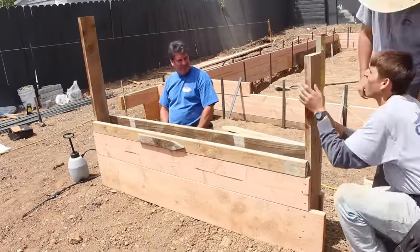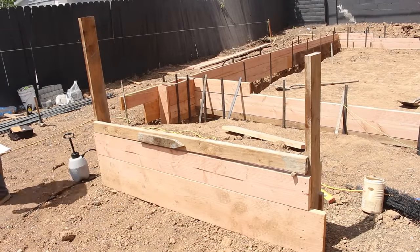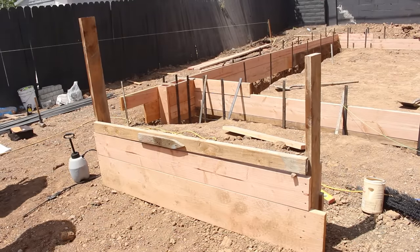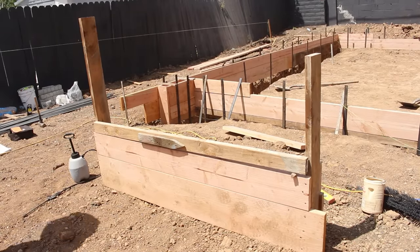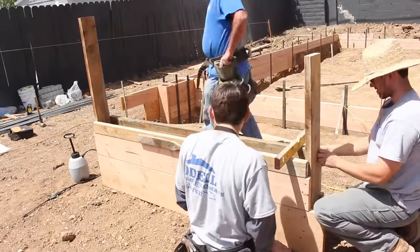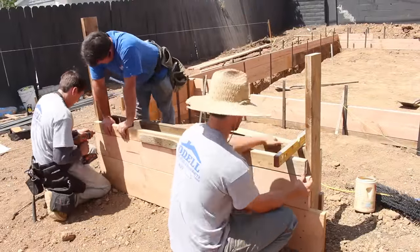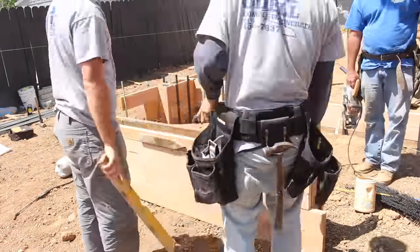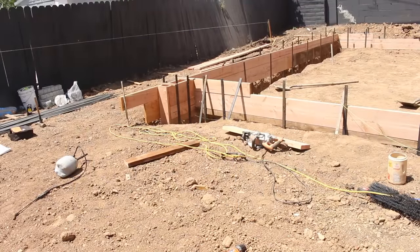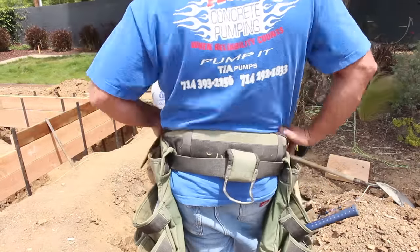I'm building this little freestanding form outside of the actual location where it'll inevitably go. I've got a two-by-six plate — really five and a half inches. What I did on this freestanding form: I grabbed some two-by-sixes, stood those upright, and slammed some wood on the sides, which gave me the width and the ends all in one shot. I cut off the extra two-by-six length and now I'm going to suspend it over the footing hole.